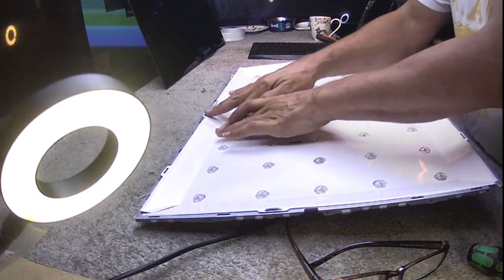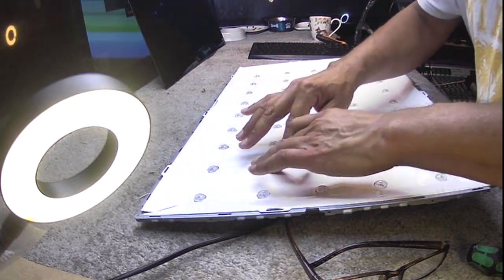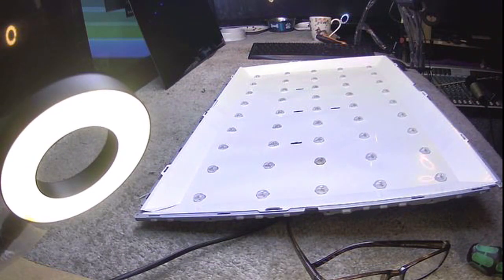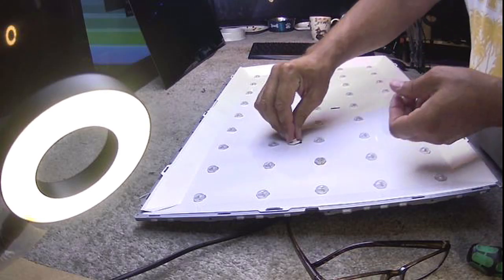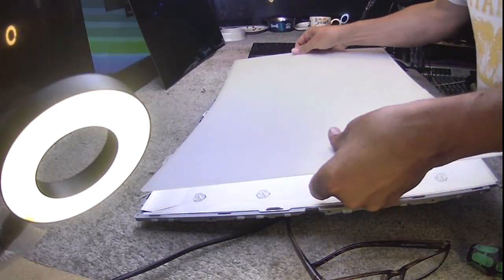There's a chance when I touch the lens in a second, it's going to come a bit loose. I've just got to get the reflector sheet behind the lens. That's the one. I did see it wobble. But we're okay, it's behind it. I'm going to put the screen supports in. And I'm just going to put the sheets back on. And then switch it back on again.